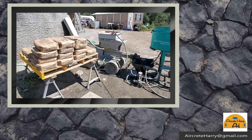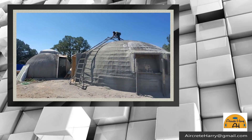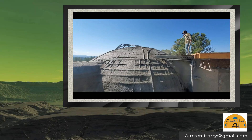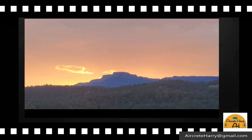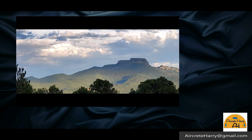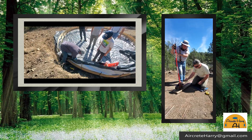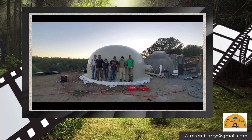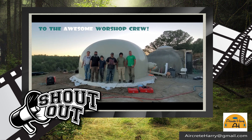This is the system we use: we had a mud mixer, a pan mixer, and the pump we were using to spray for the shotcrete. We also have a tow-behind air compressor. There I am on the custom-made ladder spraying the shotcrete mix to cover all the rebar. We ended up putting about two to three inches on the dome and about four inches on the vertical portion. Here I am teaching the workshop on how to build a foundation for the 16-foot using a ring beam system. The slab being poured was a slab-on-grade, which you can do in warm weather climates; in other climates where you're worried about frost heaving there are other systems. That was the group we had for the workshop.